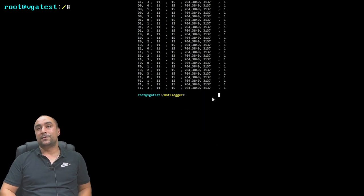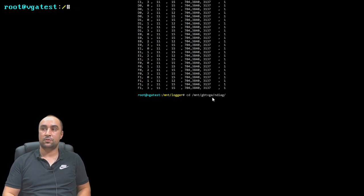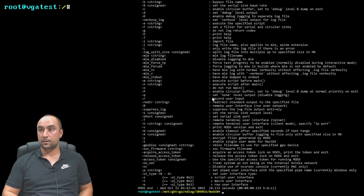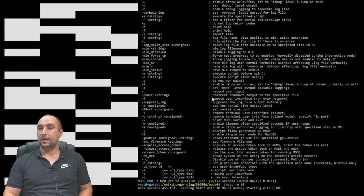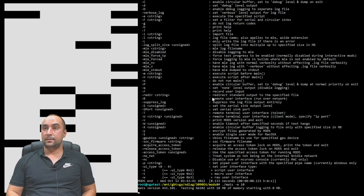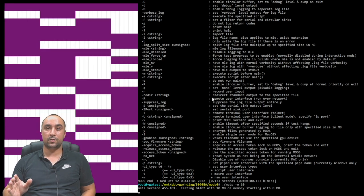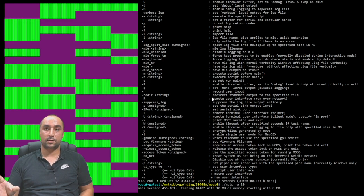Amazing. Okay, so maybe let's try to run a MATS test, because when the training status is okay, the MATS will almost always also have a good result. Running MATS with 10 megabytes of memory. And now when the card is running, the card is still missing three capacitors on one corner of the PCB and six to seven capacitors on the GPU crystal.